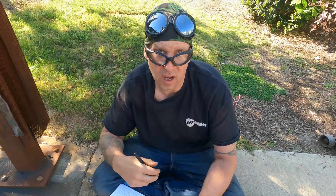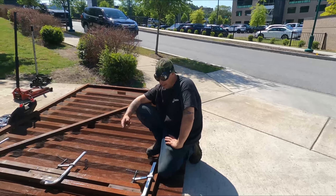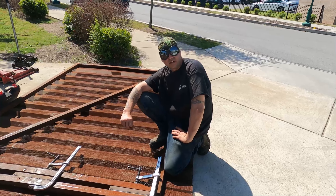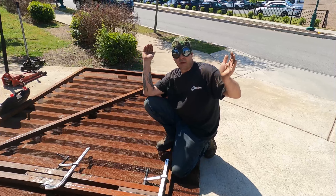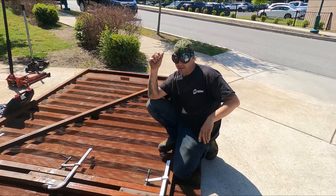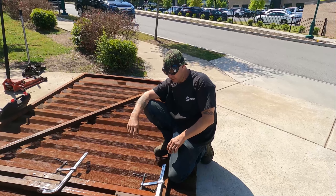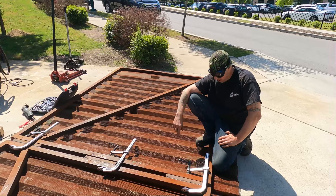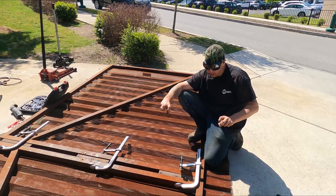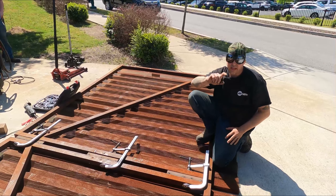...that tells me what we need to put in the middle between these gates before we clamp them together and make them one gate — so we can hang this as one gate. We need to come up with 1-5/8 inches to go between them. We might even weld them together and hang the whole thing at one time — it should slide right in the hole, we can weld the hinges off, and everything will be perfect. So we went back to the shop and made 1-5/8 spacers after doing the math on how much space the hinges took up and how much space the opening is.